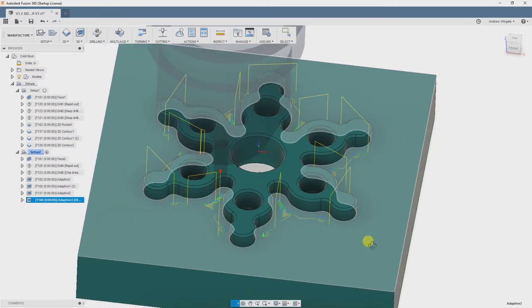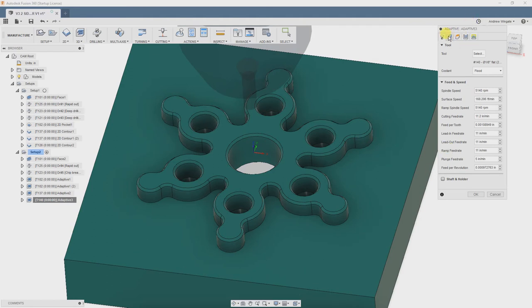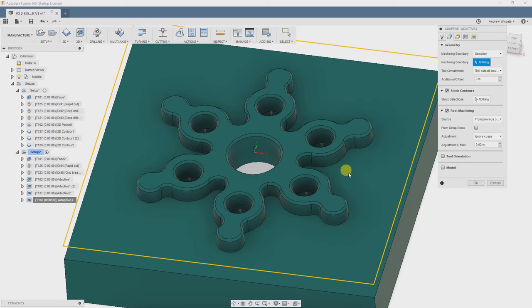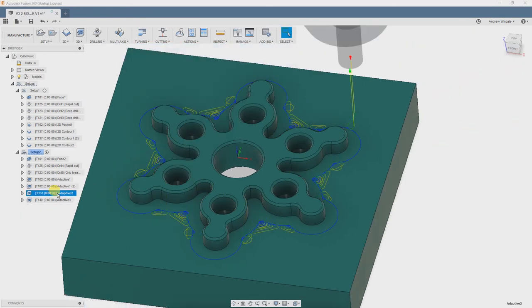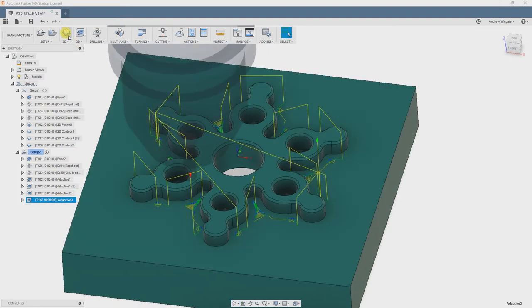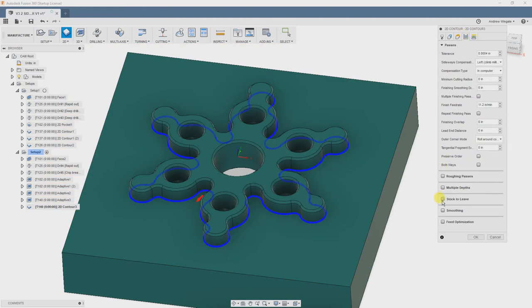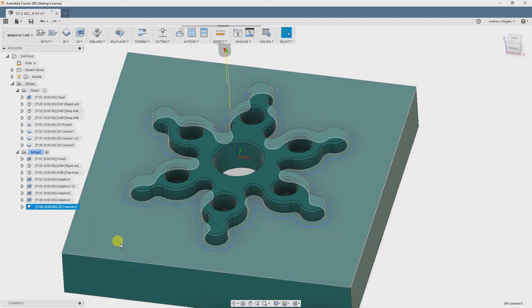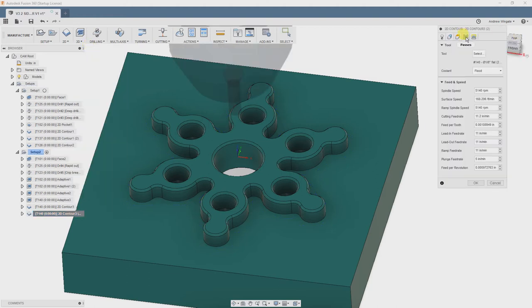There's a little mistake here — you can see that there are toolpaths in the center hole, but we did already machine that with the half-inch drill on the other side. So we're going to avoid that area. Let's edit the toolpath, go to the Geometry tab, and make changes to Machining Boundary — changing that to Selection. We're going to select the outside profile of our logo and the whole outside profile of the part. This is going to force the tool to stay in between those two selections. We'll regenerate the code — that looks good. I'm going to check the quarter-inch tool again just to make sure it doesn't have that same error — and it doesn't. So we're going to move on to finishing the profile. We're going to use 2D Contour and finish this with the 1/8 inch tool, selecting the outside contour of our logo. Heights look good, and in the Passes tab we're going to leave 2 thou for a final finishing pass. Click OK — looks good. We're going to duplicate this operation to create our finishing pass — duplicate, edit toolpath, Passes tab, and we will uncheck the box for stock to leave. Click OK. Our last operation is going to be to finish those chamfers. Again, we're going to use 2D Contour, select the 3/8 drill mill, select the Geometry tab and choose our contours. In the Passes tab, again we're going to use a tip offset of 0.050. Click OK to generate toolpath.